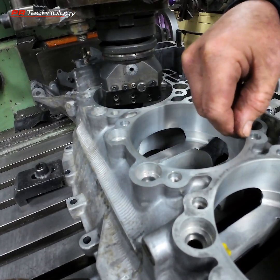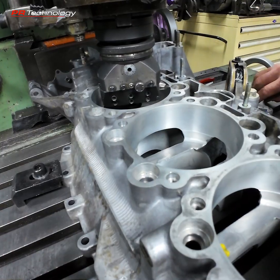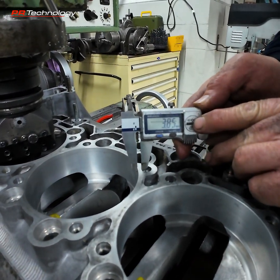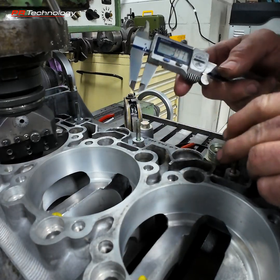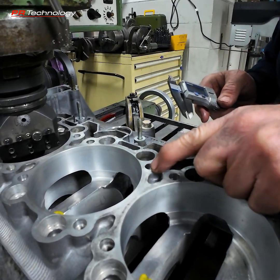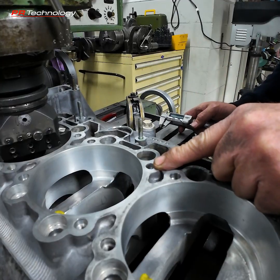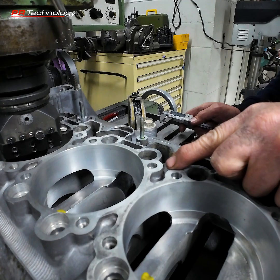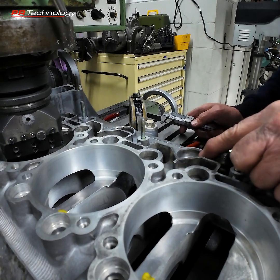If you look at the amount of thickness we've got here — our quad ring is 3.5mm and that is 3.85mm — so if you look at the outside of the thread diameter, we've only got about 0.3 of a millimetre between the bottom of the quad ring groove and where the threads would be. So it's all fairly precise; you've got to make sure everything is lined up pretty well.